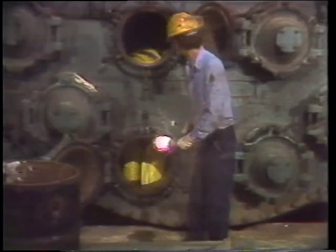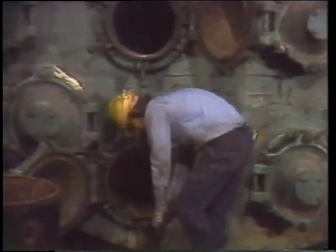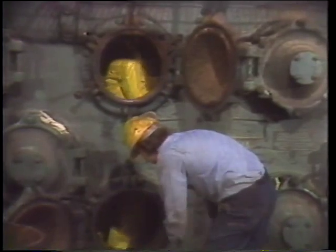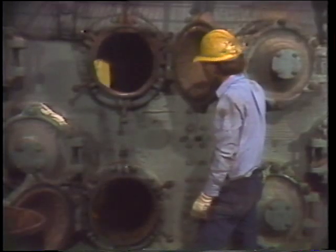Our mechanics are observing the two-man rule. This is a very basic safety rule for any kind of work in a confined space. There's always one man on the outside, not only to serve as a helper, but to ensure the safety of the worker inside. That person can call for help and provide assistance if the worker inside gets into any trouble.